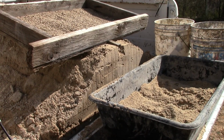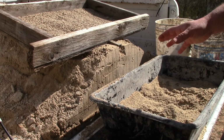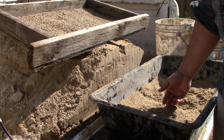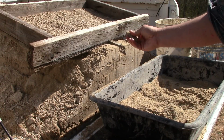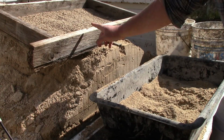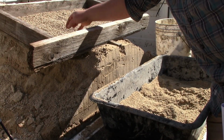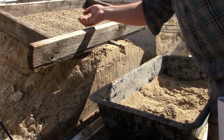So this sand looks like the real deal, but it's behaving a little differently than I'm used to. Typically, when you get your concrete sand and you open up your tailgate, it falls. But this stuff, when it dries out, it's really hard. It takes a fair amount of work to crush it. So the first thing I did was sort it through a 1/8-inch screen to see what we had, and it's got nice little gravel that'll fit through my hardware cloth easily, but it has a ton of organic matter. Everywhere you look, there's mulch and stuff.